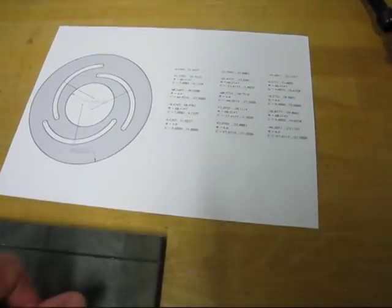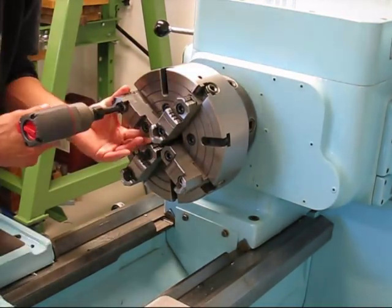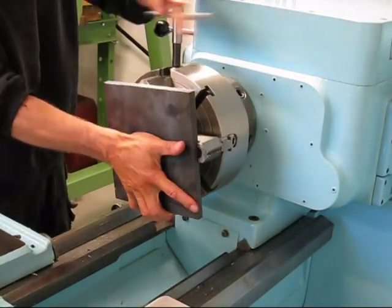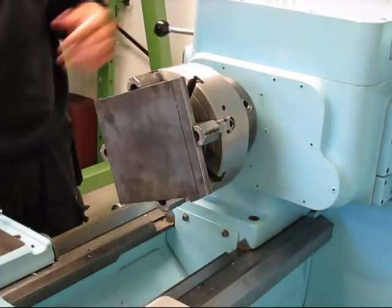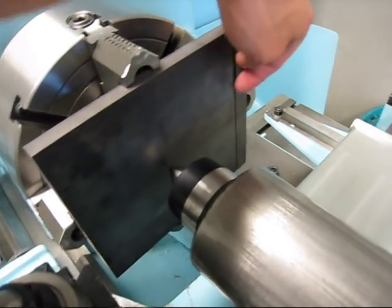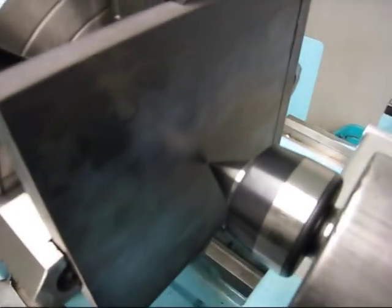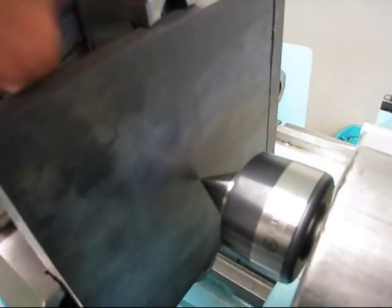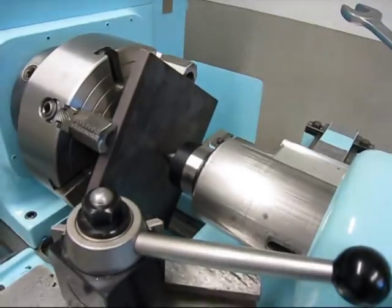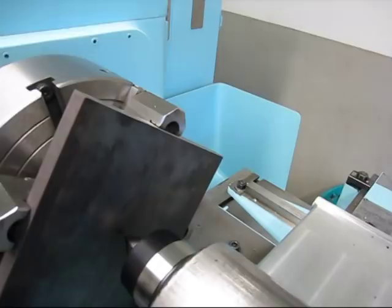Here are the coordinates for the grooves. I laid out the center between the cut line over there and the edge here, and I center punched a point in the middle. Now I've lined up the center punched hole with the tailstock center, so I guess we're about ready to try to get this piece turned.